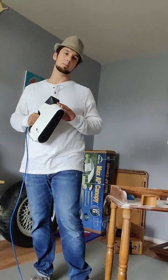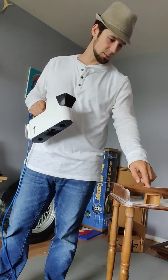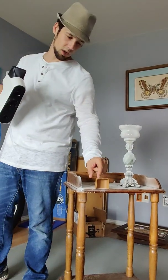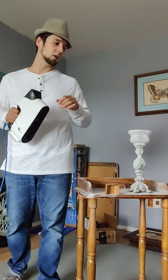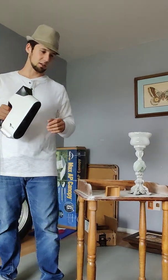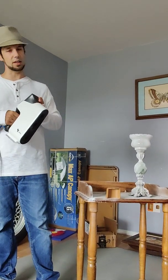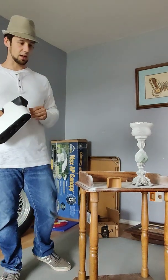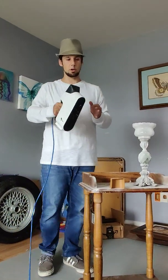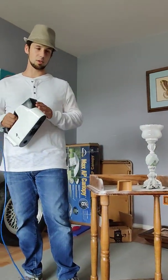So these are some great tips for not only this scanner, but other handheld scanners. This is why I've got some of these different items in here, as they kind of work as markers, where I'm not using a marker dot, and I don't really need a marker dot, especially for something this small. It does work as a piece of reference that it can shine the laser back on, give distance, and tell the scanner where it's at. So with a configuration like this, I found that it's very easy for me to do very quick scans, and for these scans to look really good without me having to go super slow or hold it real steady and worry about it. I can actually be quite sloppy and walk around this very quickly and get a really nice resolution scan out of it.